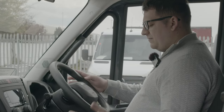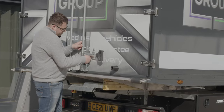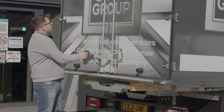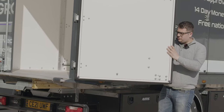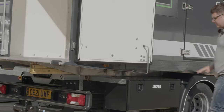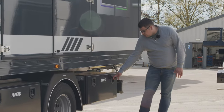1050 will be enough power to do most jobs in the rear. It tells you 1050 right there. Now we get out and go to the rear doors. To open these up so you can get into the rear, firstly you open this hatch just here — this slides onto there, just like that, so it's in position. Then flick this open over like that — watch the top — that then opens around like that. Connect it and put this back on the door so it doesn't go anywhere. Do be careful with your fingers on this; it can open just like this. That holds the door and keeps it safe.